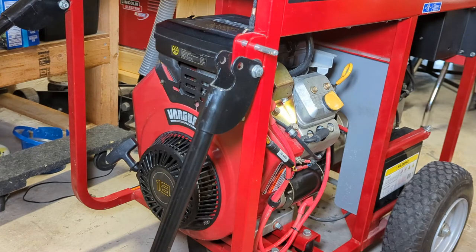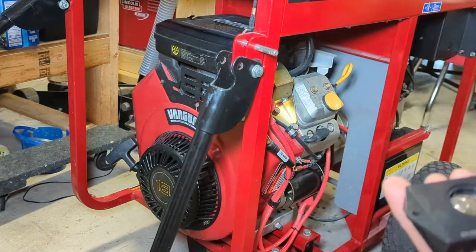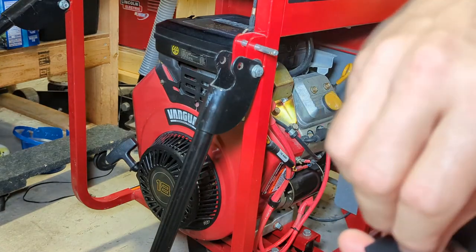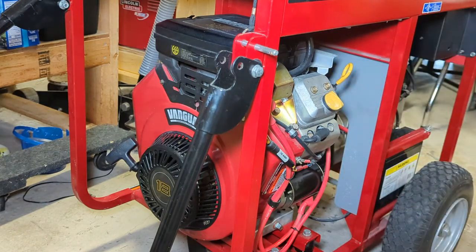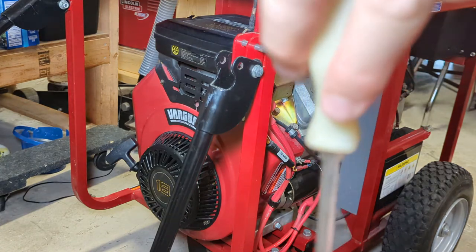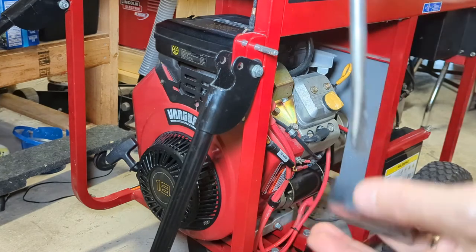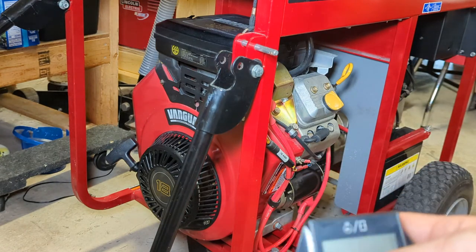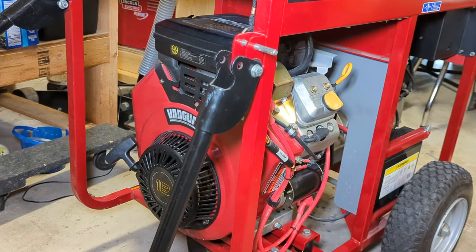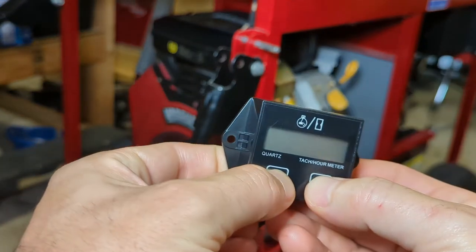Take the cover off and take a look. It's been a little while since I've done one of these. So you just remove the cover with a Phillips head screwdriver here. Yeah, there's a little piece of plastic in there. Right there. So just yank that out. Put your battery cover back on. There you go. And now when you press these buttons, something should happen. Maybe not. All right, you have to press and hold S1 and S2 at the same time. There we go.